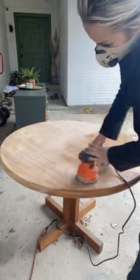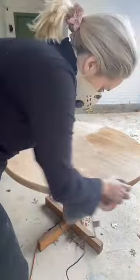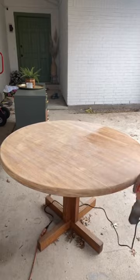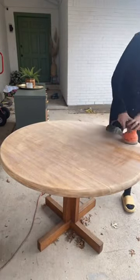Once you're done removing it, switch the sandpaper to a 220 grit, which is going to smooth it out and make it a lot less bumpy. Then you can seal it — I typically use polycrylic, and that will protect the surface. It might slightly darken the wood, but it will protect the surface and give it a great boho, lighter, more natural look.